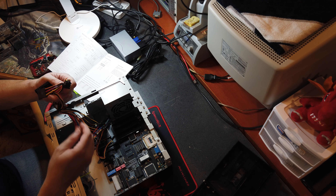Game port enable, disable, printer port select. For further programming and technical information, please read the XT and AT technical reference manual. This card doesn't have a printer port so that's fine. I'm going to guess if I remove the jumper it'll be disabled. Jumper two is COM1 or COM3 - we're going to take jumper two and just remove it like that.